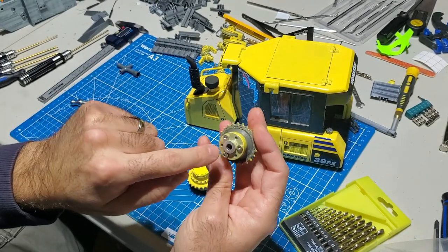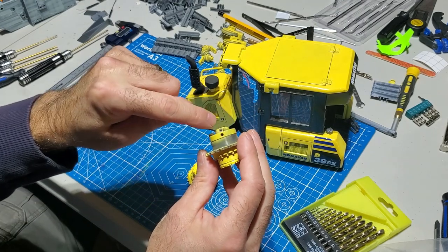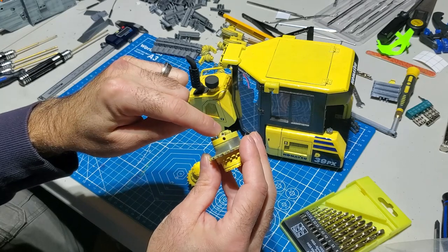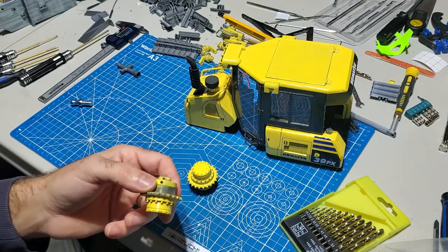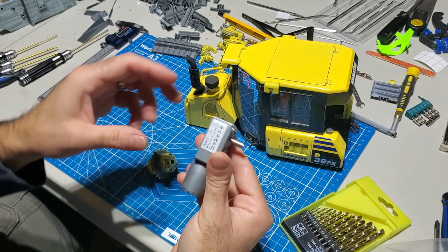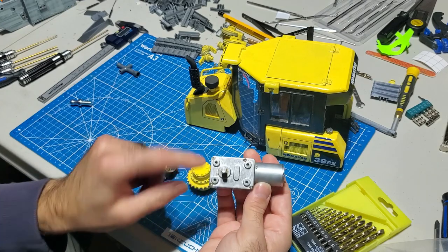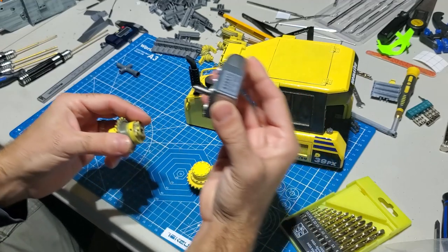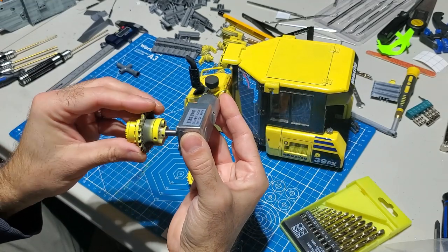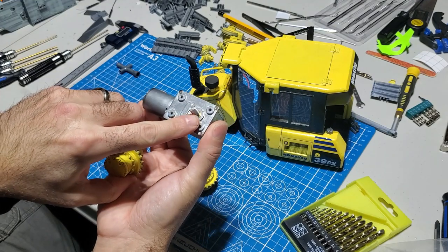On the back you'll place the hub with three screws and then it's ready to go. There is a set screw here you can put it on one side or the other - this set screw will be used to attach to the motor. I use 100 RPM motors with this style; it has a six millimeter shaft.